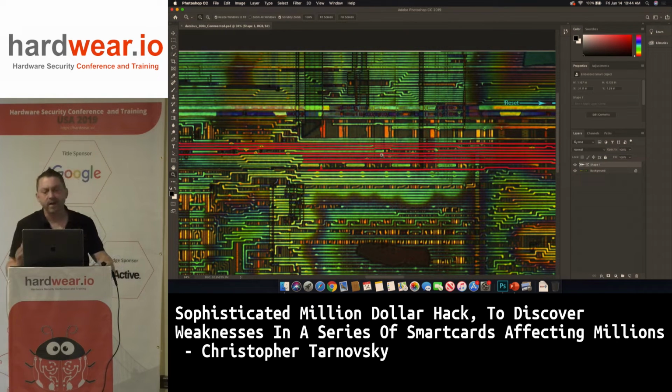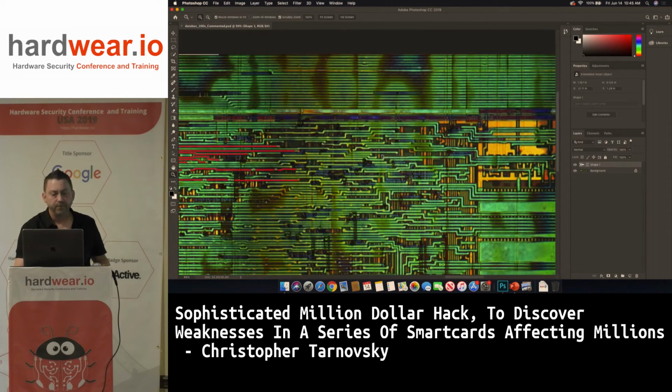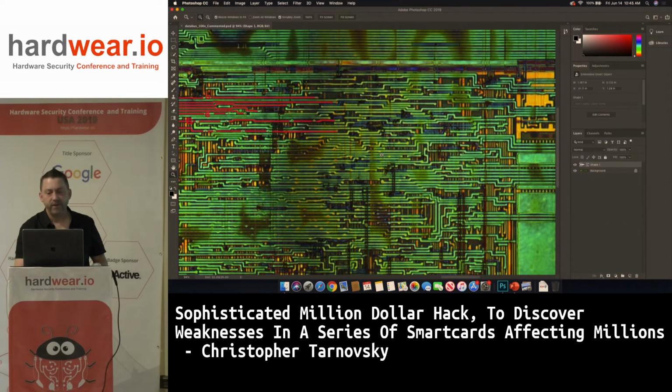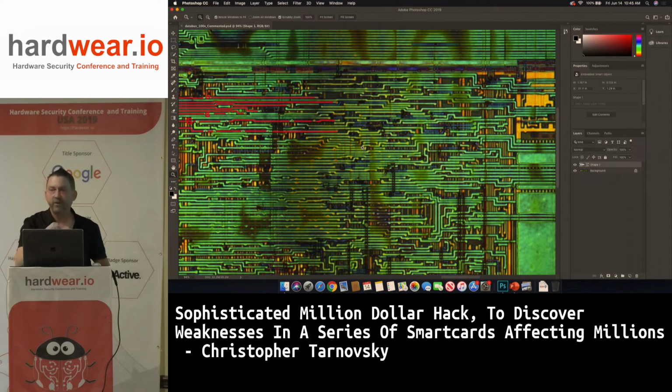So to get the entire contents out, you have to let their memory encryption decryption block get set up by the code, by the ROM code. So you can't just cut the bus on this. Cutting the bus wouldn't help you really. But what you can do is you can put a needle down on the instruction register, which is right here. I just don't have it highlighted. But there's a wire in here. I'm not going to show you which one, but there's a wire in this area that if I put one needle on it, it freezes the last instruction executed.